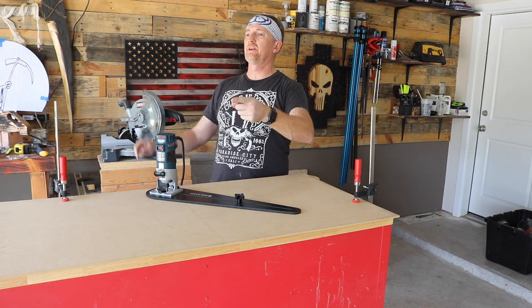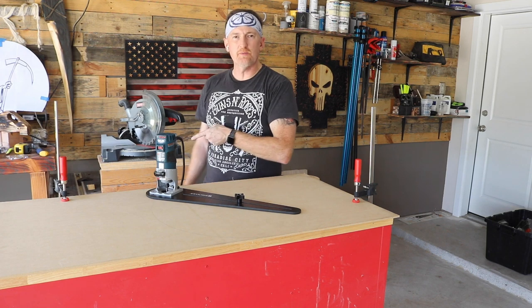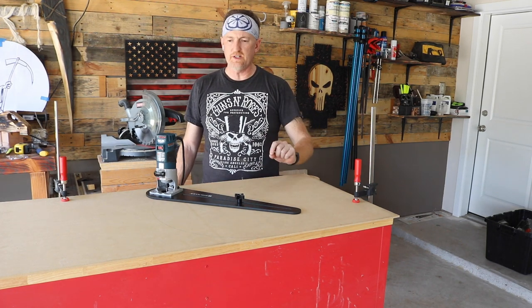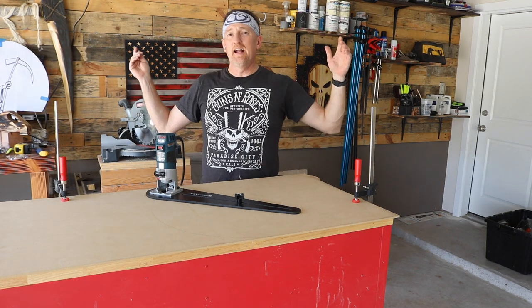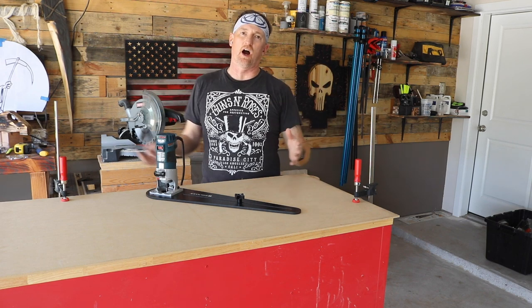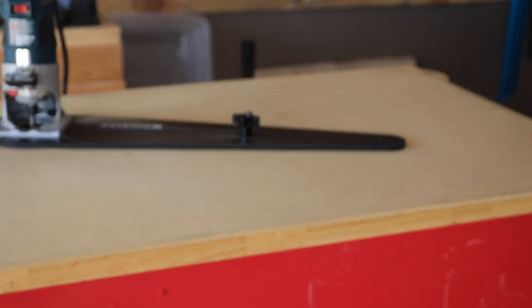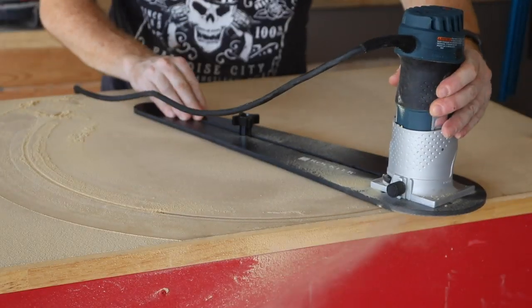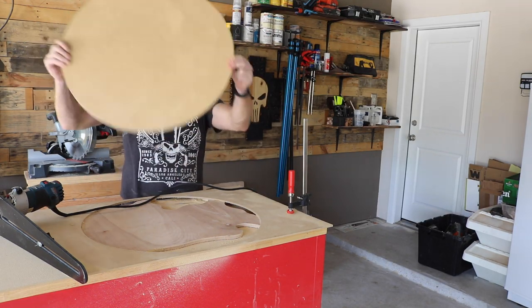We got the carving pretty much done. I'm getting ready to get the torch out. Since I have the circle jig, I'm going to do something a little different than the last table. I glued these 2x4s together and I'm going to cut out a quarter-inch MDF backer to run around the bottom of it, glue it on, and maybe tack it in with a couple of brad nails — hoping the 2x4s don't just fall apart. Almost forgot my RZ mask — don't breathe MDF dust. Not good. MDF cuts really easy, very nice.